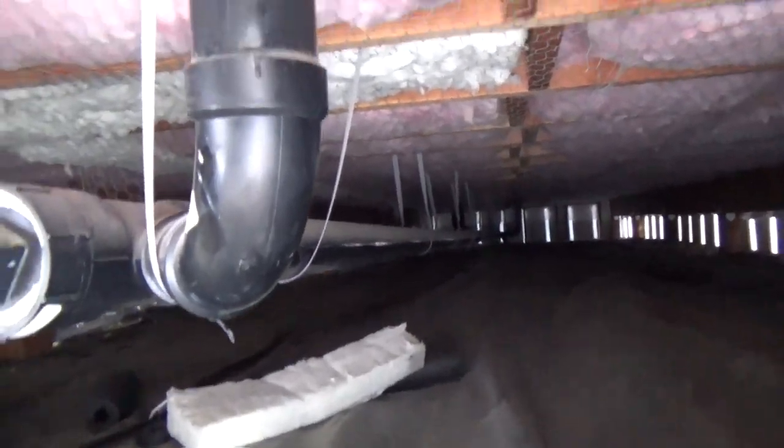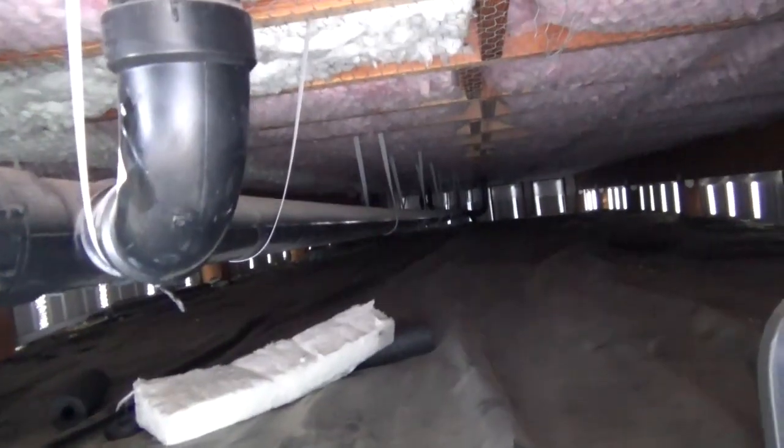Something I just realized I didn't mention is my sewer lines. My sewer lines come down and are pretty low away from the house. If you look at them, they're over a foot down from the insulation. At the time, the inspector said, wow, you should put those higher up. I didn't want to redo all my pipes, but if I had put those way up higher by the insulation and then done a drop at the end, it probably would have been a lot better. Because the only thing that really froze, other than the water supply, was the drain on the shower, which is kind of low.